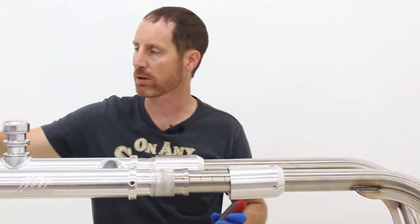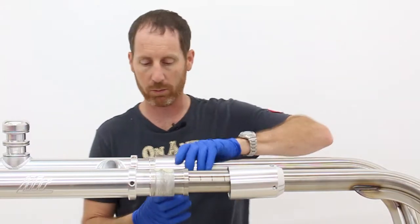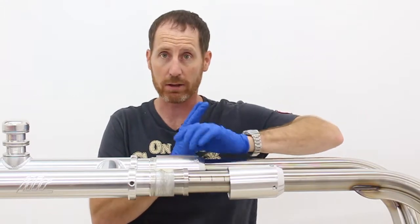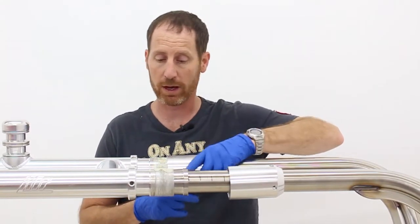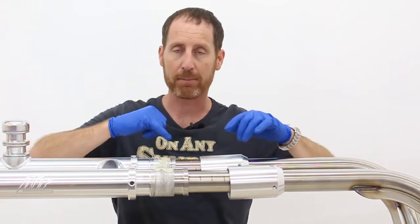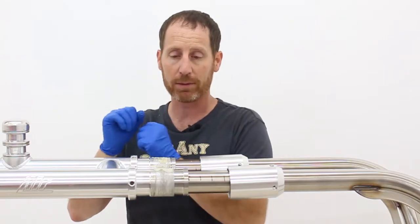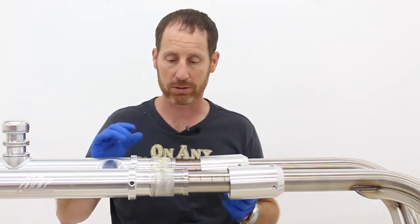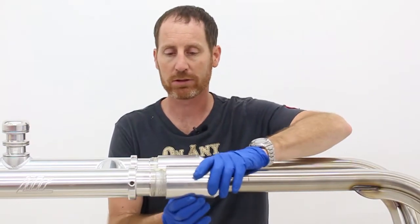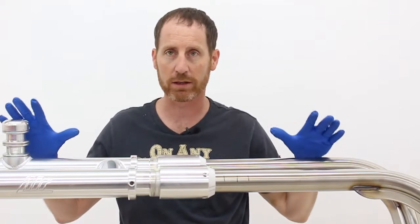And then I want to show you what it would actually look like in a form of where I want you to be. Left-handed threads on the left-hand side or port side, okay? Take note. So I'm going the opposite direction. I've got about an eighth of an inch maybe gap here. That's about where I want. I'm not going to go really tight yet. I just want to tap it until it's snug and set my set screws, and then just go ahead and put my caps loose down in place. We're really expecting our set screws to do all the work at this time. Okay, so this tower is ready to go on.